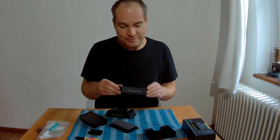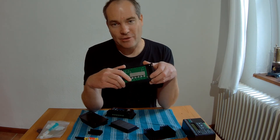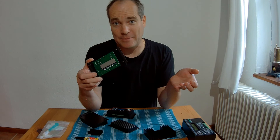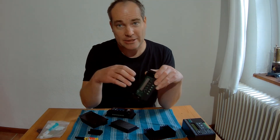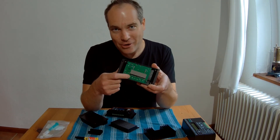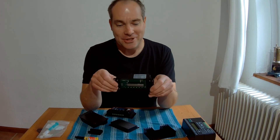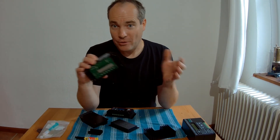One thing to mention: these solar connection points are not very robust. 30 amps is absolutely the peak for this charge controller. I know they've been sold rated at 50 or even 100 amps — you can help cool the MOSFETs with an extra heatsink, but honestly, 30 amps is the real practical limit. Sometimes it's even better to run two or three of them in parallel, so if one fails the whole system doesn't go down.